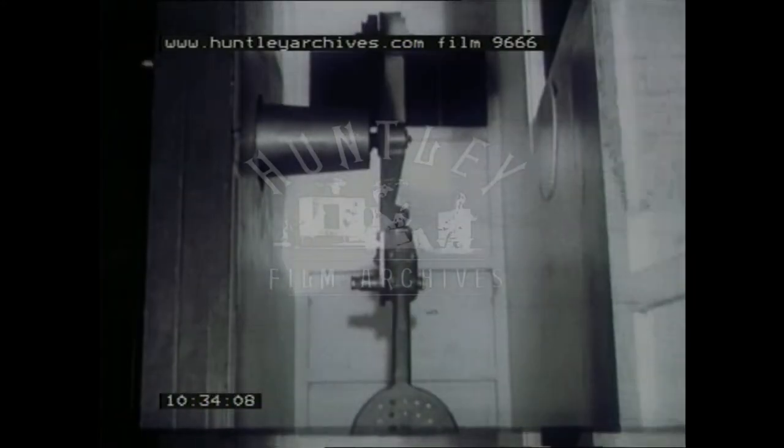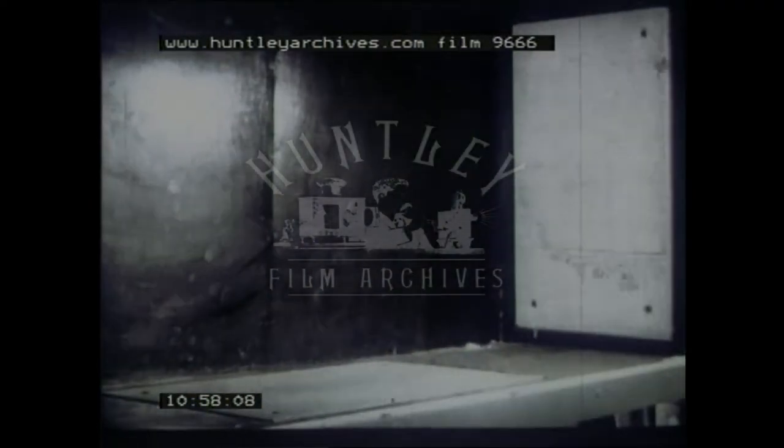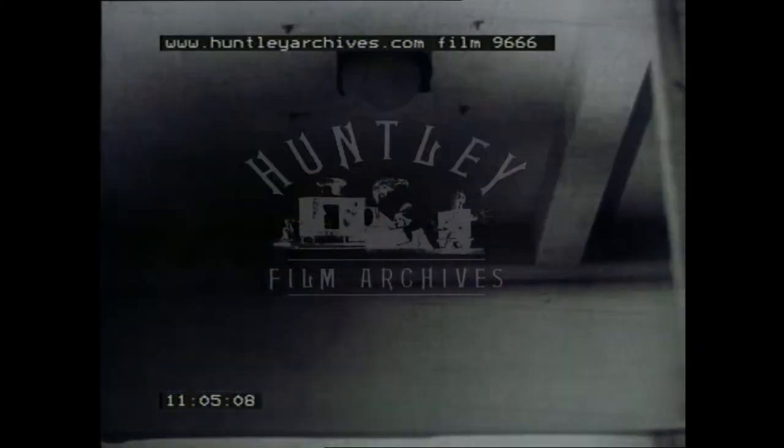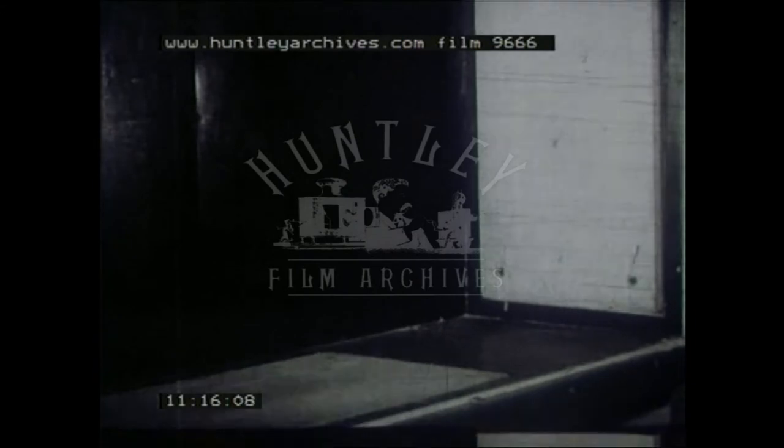Periodically also, balls are selected for an endurance test. This is carried out inside a long cage. At the far end of the cage is a compartment containing a large metal racket mounted on a revolving shaft with a heavy counterweight on the other side. The machinery is started up, and the balls are fed into a compartment at the top of the cage from which they are passed through a hole by a timing device at the moment that the racket is coming round. Here you see the process in slow motion — strike, and back into the loft. A ball's got to have something pretty good to stand up to this treatment for long.